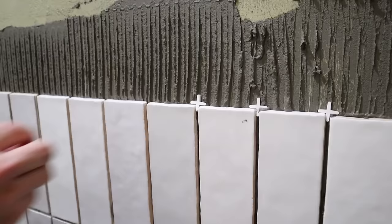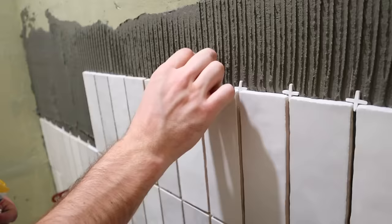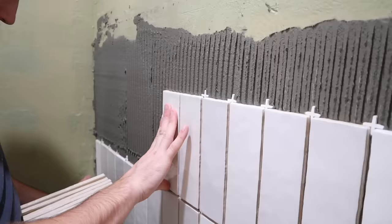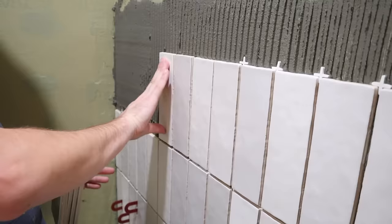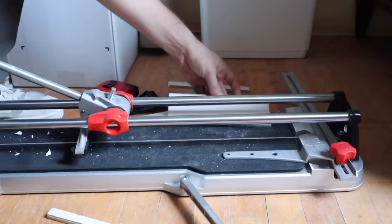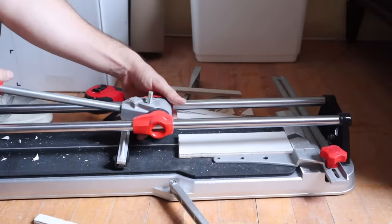We're just doing the back wall of the shower in this video, using 1/16th spacers. Christian saw in a YouTube video that if you push cross spacers far enough back between tiles you don't have to pull them out — the grout will just cover them. We used a laser level and also did a dry lay the night before, laying all the tiles out on the living room carpet and rearranging different color variations to make it look balanced and thoughtful, then organized them into neat piles.